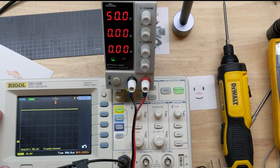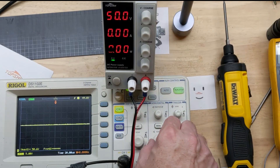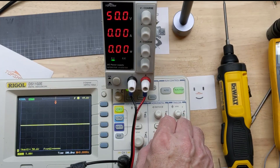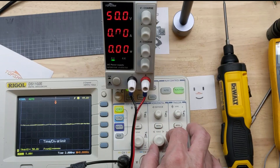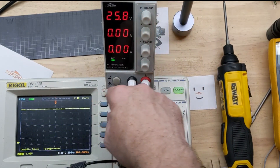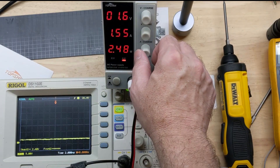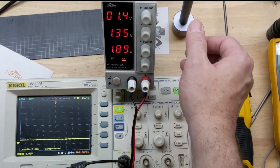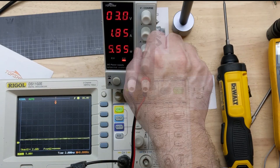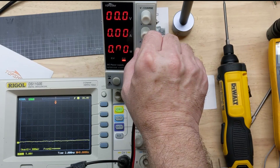Hopefully you can see the screen — we're showing 50.4 volts V-max and there's hardly any ripple here. If we look all the way down to two nanoseconds, ripple is extremely good — very smooth. Let me put a load on it to double check. With the current control coming in, we still see ripple looks good with a two watt load — up and down in millivolts.